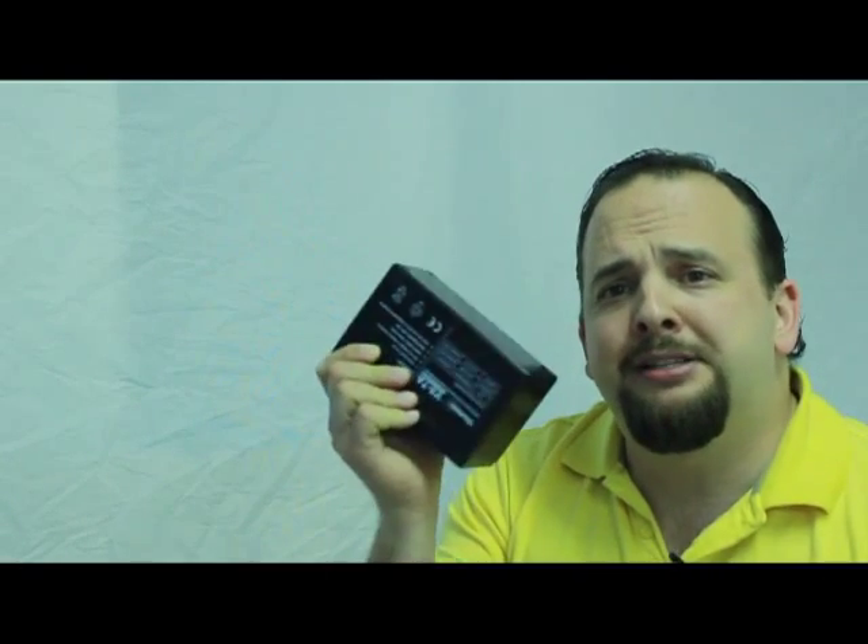The battery protector. Many of you would know that if you take a typical lead acid battery and you discharge it beyond a certain point, you are in fact creating a very effective yet expensive paperweight. So in a typical backup application, if you have a sustained power failure, your application — your little GSM Commander or whatever you're powering from that battery — will draw power and drain the battery way down to a point where you're actually destroying it. The next time you have a power failure your battery just won't be there, and with your luck you'll probably be 500 or a thousand kilometers away.